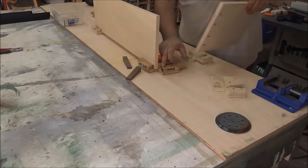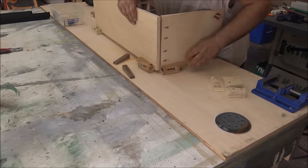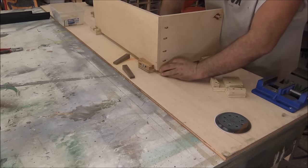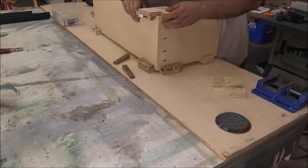You can adjust this to accommodate materials from 5/8 of an inch all the way up to 1.5 inches. The corner clamps are really simple to use — simply line up the boards, push the wedge forward, and just some hand pressure is enough to lock it in place. Put another clamp on the top and you're good to go.